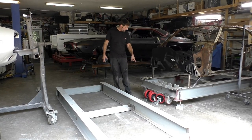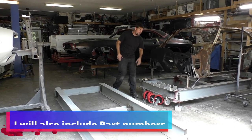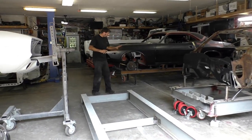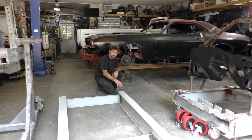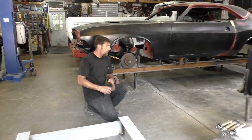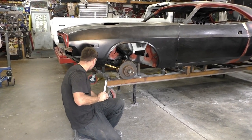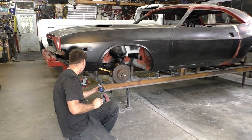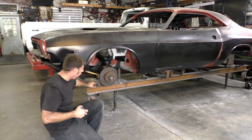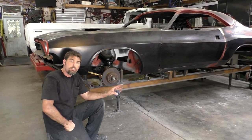We're going to install some casters next. You don't have to have these I-beams - they're really big. This was our first frame jig right here. It's four inches by four inches with gussets in it. For levelers, we put trailer jacks on the front of it and it still does its function. I do my frame jigs out of I-beams, but you could do them out of square tube with a triangle piece in the middle - there are different styles and they all work.